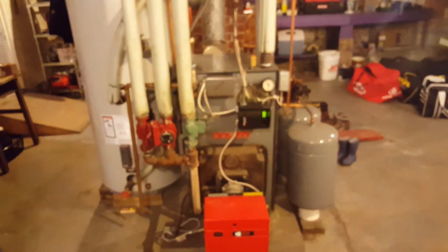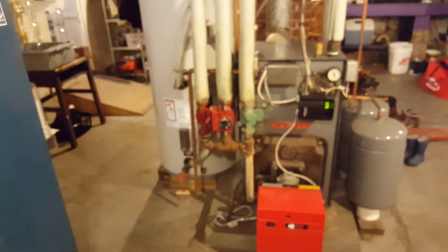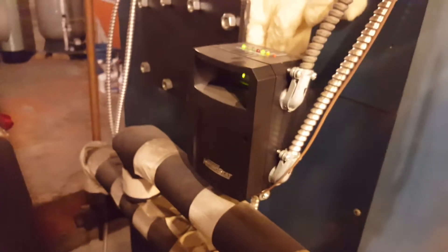It's on the coal boiler right now, and you can see the Aquastat says PUR for purge. What it's doing is preventing the stoker from firing until the temperature of the boiler water reaches the control set point, which I have set at 150 low.